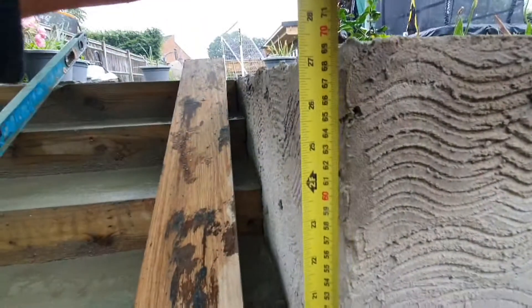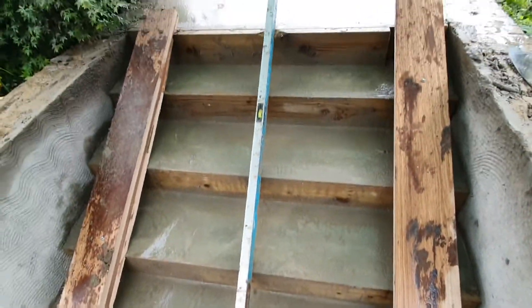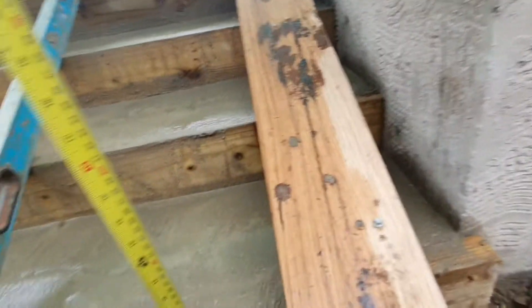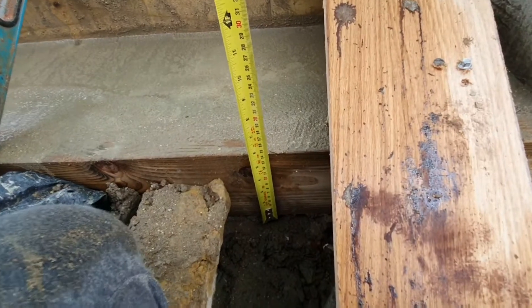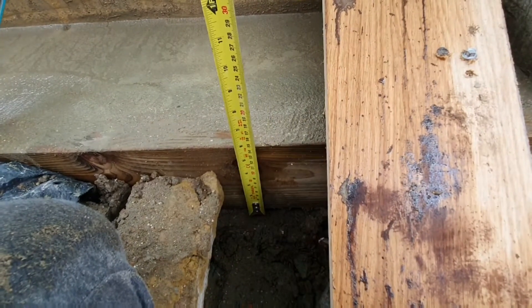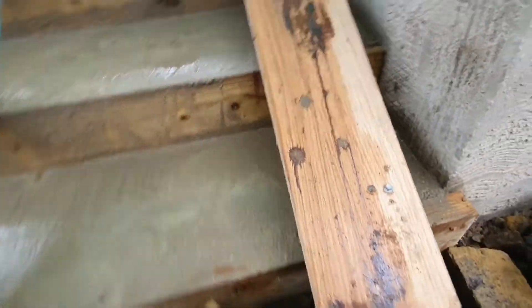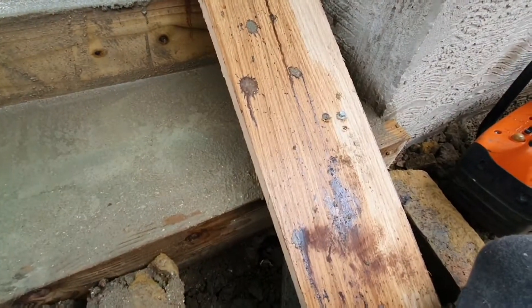The top of the wall here was 720mm. Once it's built up a bit, so I divided 720 by five steps — one, two, three, four, five — and that gave me 144mm, which is perfect. So we knew it was going to be five steps to get to your height.